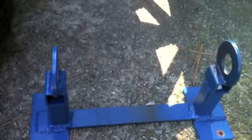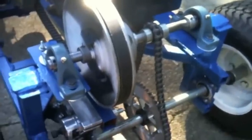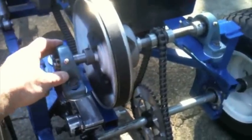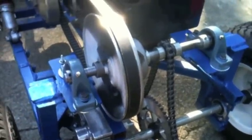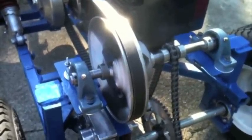These brackets are the ones that come when you buy a jackshaft, and the bearings that came with it — one of them actually seized up because they were not very heavy duty and because it wasn't mounted exactly in alignment, so it burned one of them up. So what I did is got some industrial strength pillow bearings. They're about 25 bucks each, not cheap, but they allow for some play for that jackshaft to self-align.